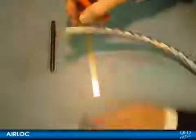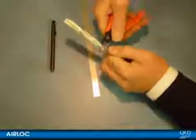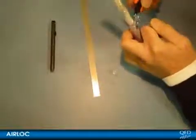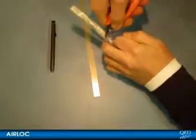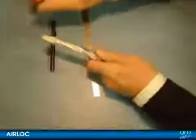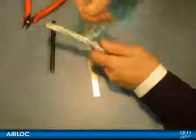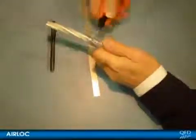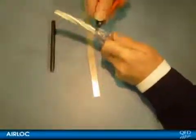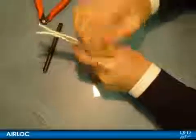Once you've got started the jacket will peel away easily in two pieces, which you can cut away with your cutters right at the base. Underneath the outer jacket you'll see the five elements of the silver spiral geometry. There is an outer mylar wrap which binds the whole together and which must first be removed. Beneath this are the two bundles of conductors within their polyethylene insulators and two spacer rods which keep the conductors spaced at the optimum distance. Both the dielectric and the spacers help to maintain a uniform capacitance between the two parallel conductors.